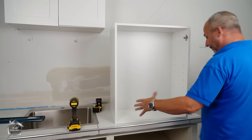Now we're going to take our drill and pre-drill our holes, something really super tiny. Just to make sure, you can always put the screw behind the drill bit and make sure you can still see the threads. That actually might be a little bit too thick. We're gonna go to a 1/16, which is almost non-existent. Look how tiny this is. It's a pre-drill.